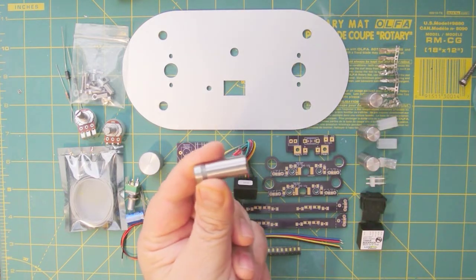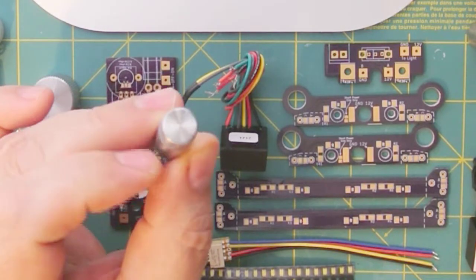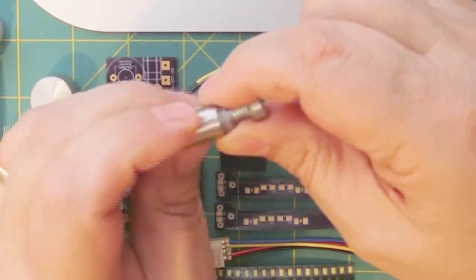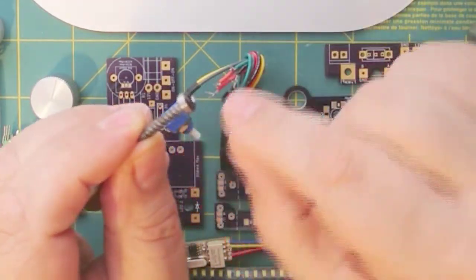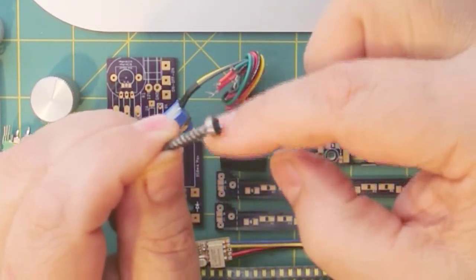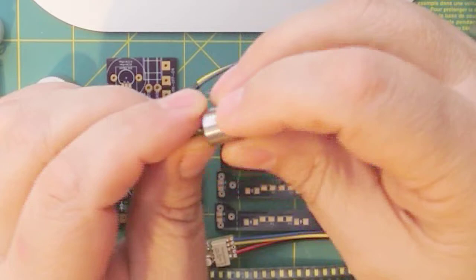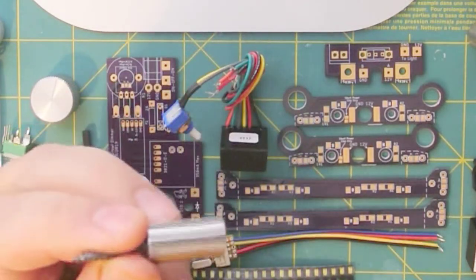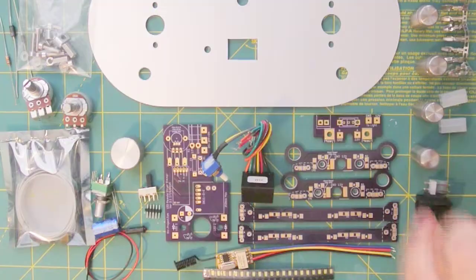These are the standoffs for the shadow box — they're a little bit larger in diameter and quite fashionable, designed for glass. When you take them apart, they have a couple of nylon or rubberized washers that would go on the glass, which you can use if you want. The way these work, you take a screw — a standard screw you might find in an RV — and I had to grind down the outside so it would fit. You screw this into the hole, then put the plate on, then put the cap on, and that captures everything.